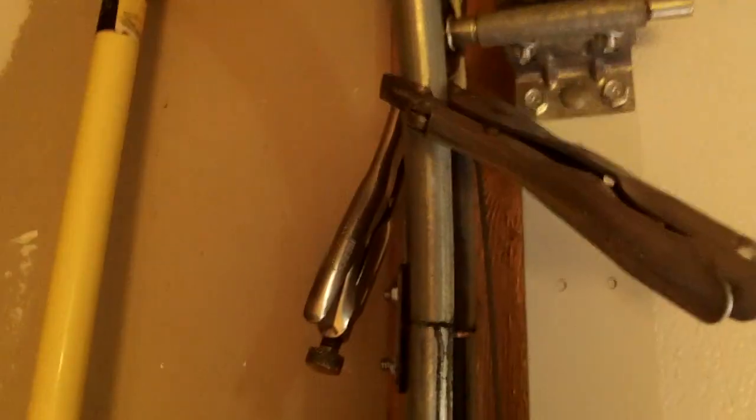It's a little different than a regular, but that vice grip there holds the section from flopping, because you got to take off the actual roller holder with its pinch resistant sections. So then you got the vice grip holding it up there, and then we always put a vice grip on the cable. So when we backwind the spring, it holds the tension on the cable.